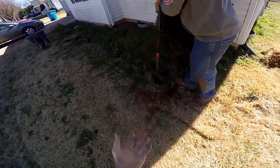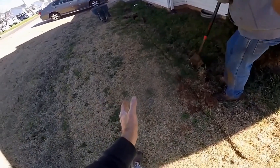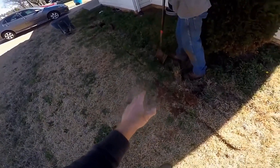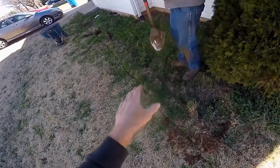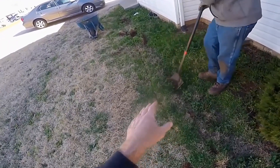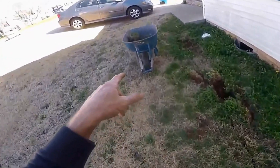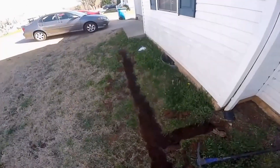Because we're going to bring our gravel to grade, it's going to act like a channel drain. Water will come down the hill and just drop through the gravel into our pipe. So we want to go ahead and cut the sod off so that we can contain the gravel. We want a nice, clean trench — not too wide — because we want that gravel to be contained. Cut the sod off, put it in the wheelbarrow, and haul it around to the back and dump it out.